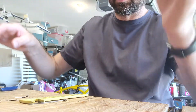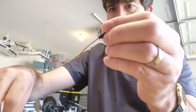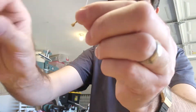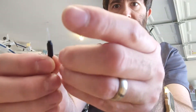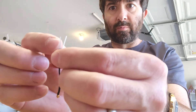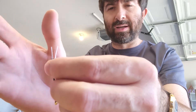I'm cutting VTX antennas right now. These are tiny shorty ones, all basically the same idea — they're quarter wavelength antennas. For 5.8GHz, the full wavelength is four times the antenna length, so we cut them to about 12.9 to 14 millimeters. If you want to be safe, cut closer to 14 millimeters and then you can slowly clip them down.